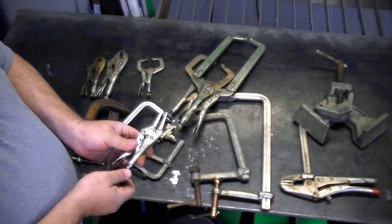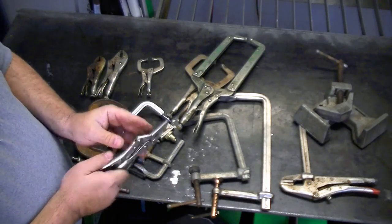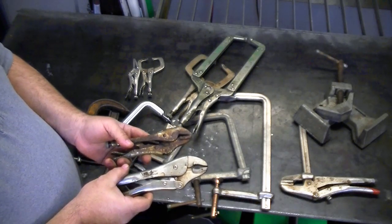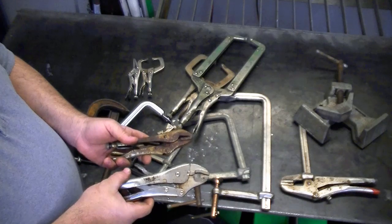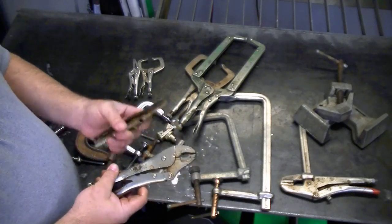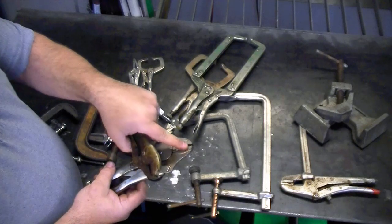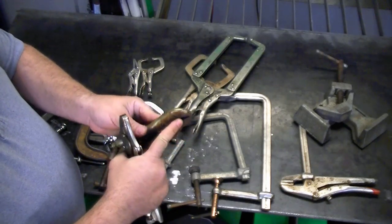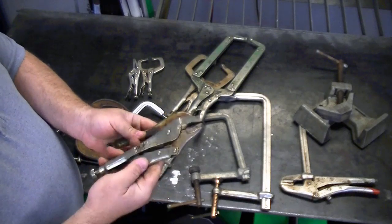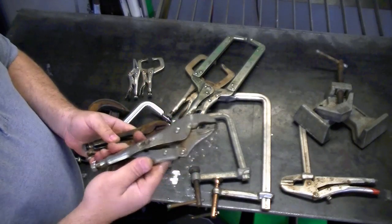Even a little locking plier like this is sometimes helpful in welding — when you just need a small piece held, a very delicate part. If you're TIG welding, these really come in handy. I've got two pairs of locking pliers here. You have two types of noses: one is more of a mechanics-type nose with a rounded feature in the throat to grip something round, and the other has straight jaws for gripping sheet metal or plate metal while you're welding. I do use both types, and if I find them on sale I'll buy another set.